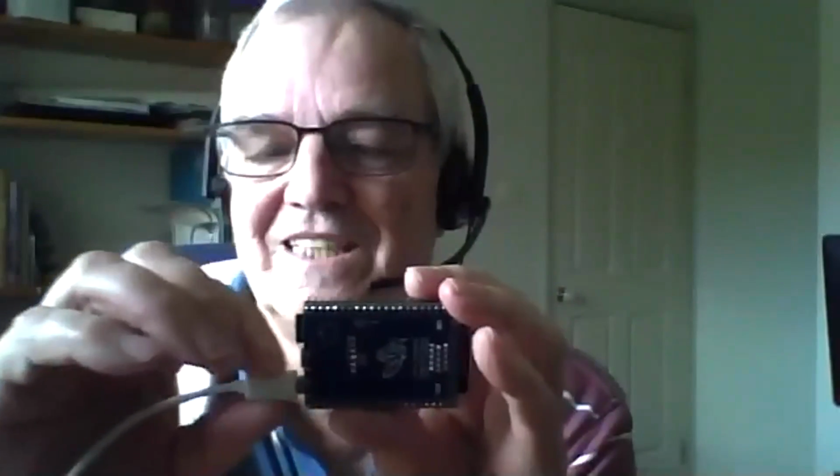I've had the keyboard plugged into there. The easiest way with plugging in, because these are micro USBs, is a little $1.50 dongle. It has a female USB-A on it, and just plugs in like that, and then you plug your keyboard into it, and it's a nice tiny little connector. And yes, 2 of them will fit together, but that's how I designed it.